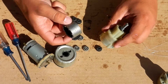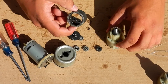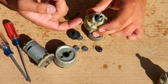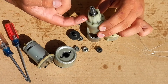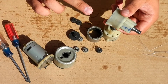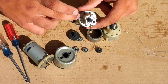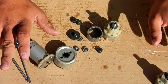If you have ever seen the ones that have the adjustment for the slip — for the torque setting — that is where these holes come in. They usually have ball bearings riding in here. This particular unit doesn't have them. However this unit had them. I did a slight little modification and took them out and forced this piece up in here, so that way the bumps would be right in there where the balls go, so that way I have no slippage.